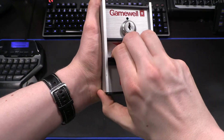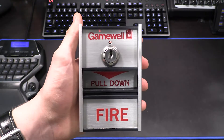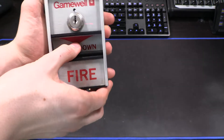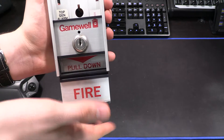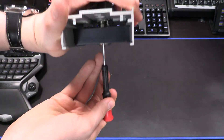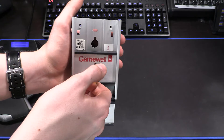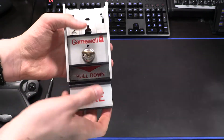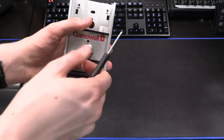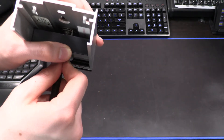It pulls down and actuates the exact same way, sliding up and down on the little rails. For the M69-4, a key is required to reset this — but as Nick said, not in the way that you would think. The actuation is the exact same method as the basic M69, so everything just slides down on the rails. In order to reset it, you can't just put the screwdriver in, because there is a little tab from the cam lock that's blocking your ability to get to it. So you turn the lock to move the little locking piece out of the way of the hole for the screwdriver, and then the reset procedure is just the same as the M69.